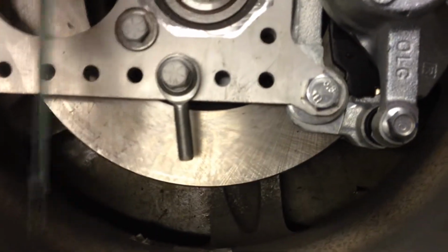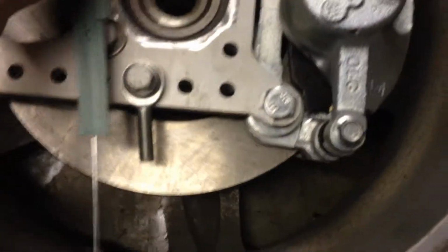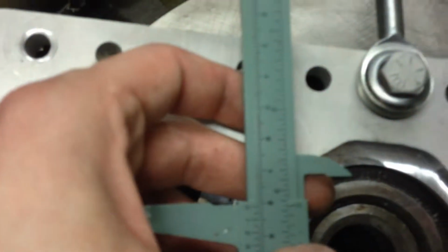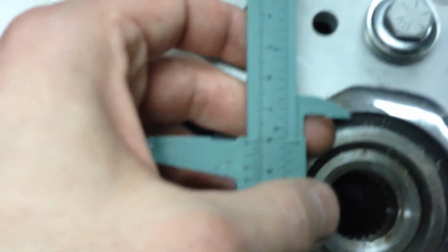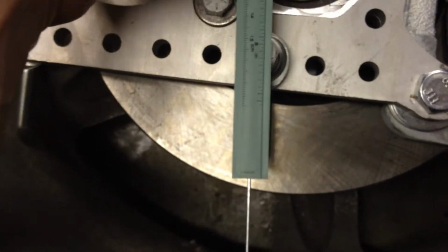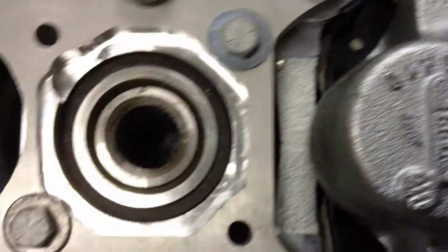So here's a $1.99 Harbor Freight caliper, which will give us to a millimeter easily, but not to 1/10 of a millimeter. And we see that we have right about, here's the depth gauge coming out, approximately 81 millimeters. So it looks like we have over 80 millimeters of clearance, because actually here we'd be right on top, and we'd actually have even more. So I wonder if it's actually even 85. Looks about right, and it looks like it's 84. Okay, and I assume the top would be the same because the distances are identical.